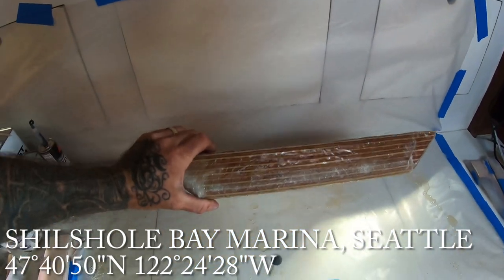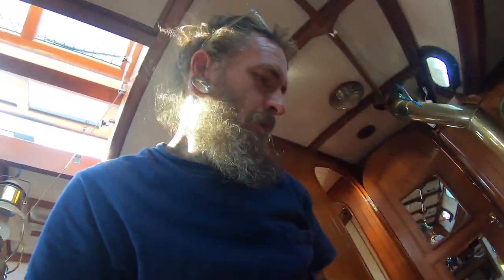Today we did two layers of glass on the bottom of our mast step and we're getting ready to put it in. I'll do a dry fit real quick, but I'll show you what else we did - we sandwiched the original key brace with some new supports. It wasn't compromised or anything, we just thought it'd be good to give it a wider footprint. Now we're going to put some glass over this, then put more thickened epoxy on that, and then put our step in and start doing our layup on top, which will tie us into the hull.